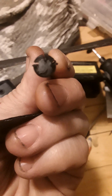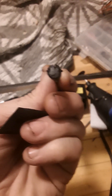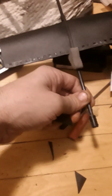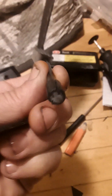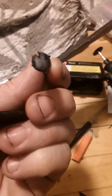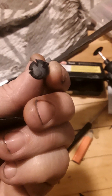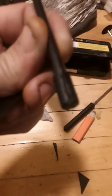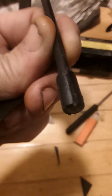I did widen these slots slightly, but you can see in more detail now the slots I'm talking about — they are pretty much perfect. This one still has to be widened out a little bit, so this is where you get your opportunity to perfect them. When I widen this one out I'll look very carefully, and if I even think for a split second it might be off in one direction, I'll put a slight downward pressure on the Dremel as I hollow out this little channel and it'll correct that.